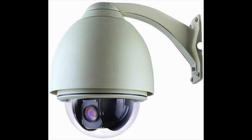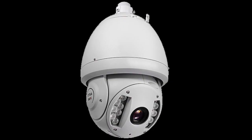Here's a bigger PTZ camera, similar to ones you'd find at banks, office buildings, police stations, and city centres — you'll probably see them on big buildings, on corners, on the side, and in ceilings. This is the eyeball PTZ camera, and it does have IR. The other two larger PTZ cameras don't have IR — they rely on low light — but they still see well in the dark and are also very fast because they're high speed.